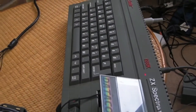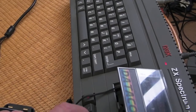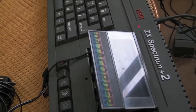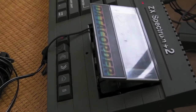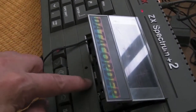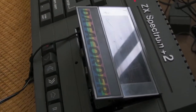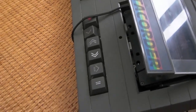The reason I did that is because I didn't really like leaving the heads disconnected. It just seemed a bit of a fudge fix. And there's even more background hiss, the distortion noise in the background there. There was a lot more noise when you had that lead flying out the back, and I guess it's because the length of the lead was picking up noise. The circuitry where the head's connected is not designed for a length of lead that long, with the impedance or resistance at the end of it. I did revert that back.